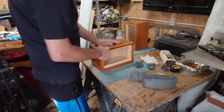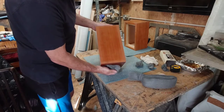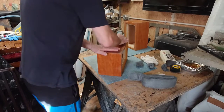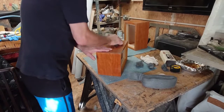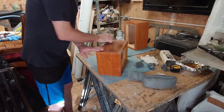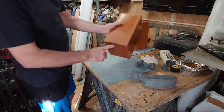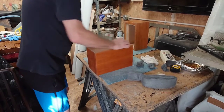Still hot today. Right, as you can see, we've been around the edges there. You've still got the centre that's glossy. So now we just tap out our wire wool and start going over the top of the outer line that I did across the grain, so it smooths it back in again. I'll show you. It's very difficult to see on the camera here. You can see I've gone back over that now. See the glossy bit there? I've gone over the edges, and the same again here.